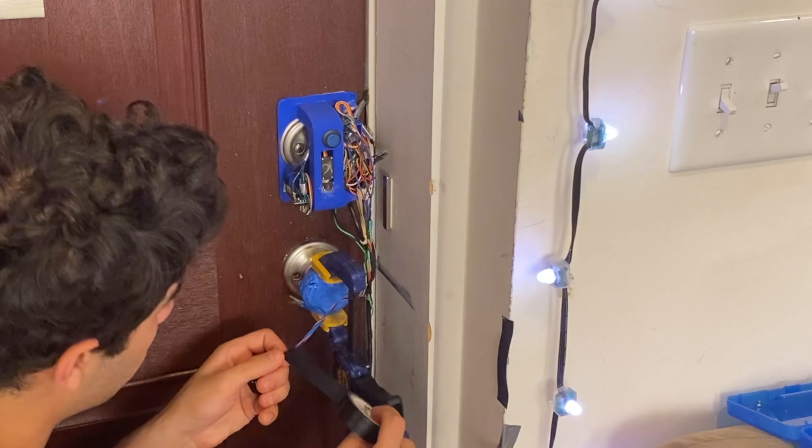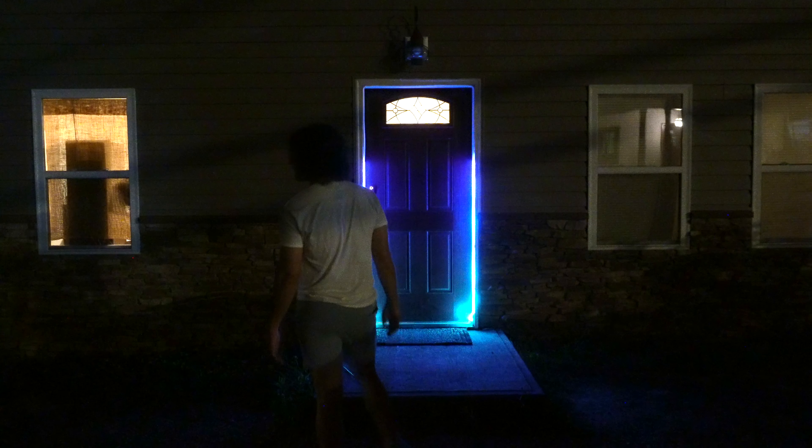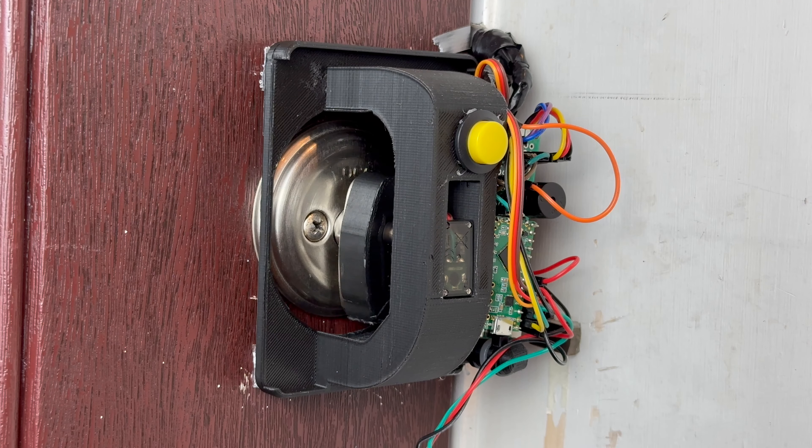There's no way to bypass the lock by shorting wires — the fingerprint library generates an encryption key every time the system restarts, which is used to encrypt fingerprint data between the reader and the Arduino. You'll also need a hall effect sensor so the door will lock when closed, plus a strong magnet taped to the wall. Finally, you'll need an individually addressable 5V LED strip, and a 5V power supply — mine is 5A, but anything 3A or greater should be more than enough. If you have questions or want a kit or custom PCB, fill out the form in the description.